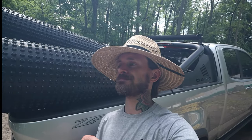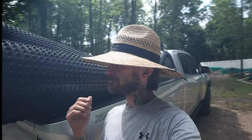When looking for a dimple membrane, we looked at several different products. It really came down to cost. This stuff here was $150 a roll, and we only needed 4 rolls for the entire house. I also got it at Menards, so of course it has an 11% off rebate. And the good thing about it is I only needed 4 rolls because it comes in 65-foot lengths, while other products only come in about 50-foot lengths, and some other products are only about 4 foot tall.